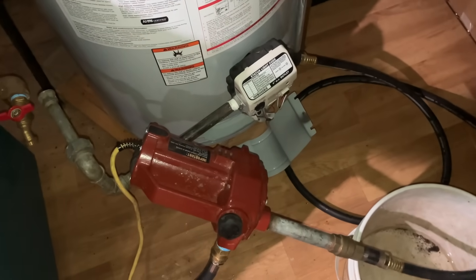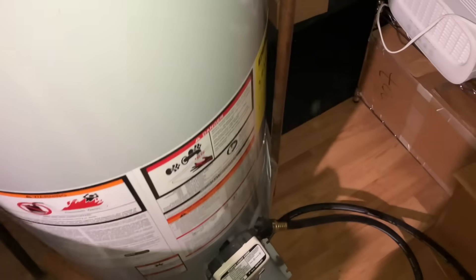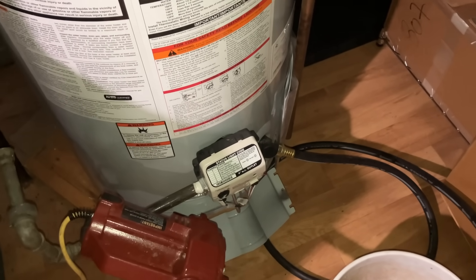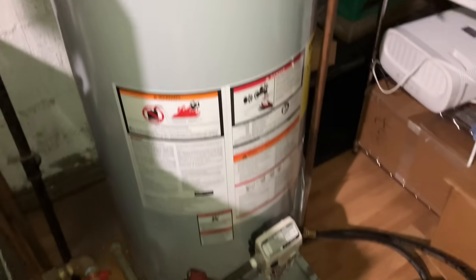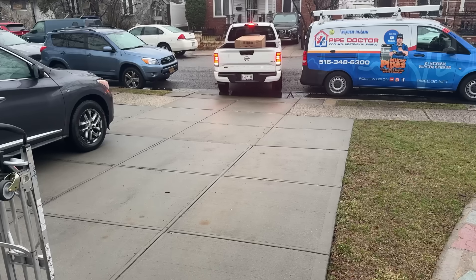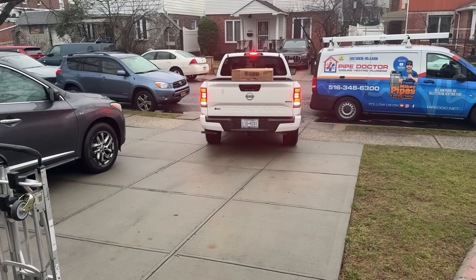We are still pumping down. I disconnected the domestic cold water there and the domestic hot water — which includes the boiler feed — there. The water heater is now significantly lighter, but that valve was really having a good time — it didn't want to come out. I wasn't going to risk cracking it on this 40-gallon, so it is what it is. Slow and steady wins the race today. Peter has arrived, and the unit fits conveniently in the back of his pickup truck.